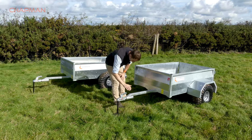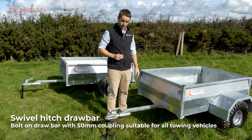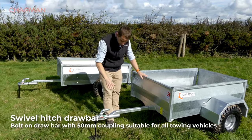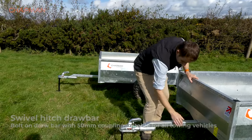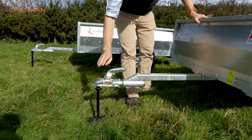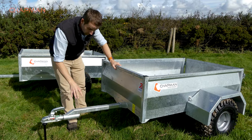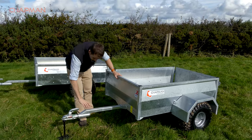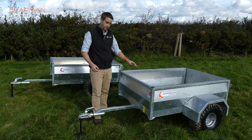Starting at the front of the machine, you've got a swivel hitch to comply with health and safety regulations and prevent any issues in the event of a rollover. You can also, because it's got a bolt-on drawbar, undo the bolts underneath and rotate the drawbar to account for different hitch heights. We've got this one set for an ATV hitch, which is quite low. If you've got a 4x4, for example, it's got a taller hitch — rotate the drawbar around and it means the trailer runs nice and level behind the different vehicles.